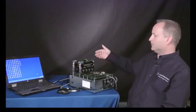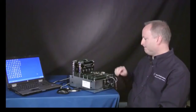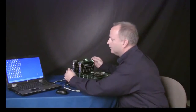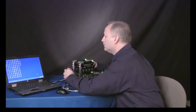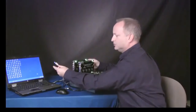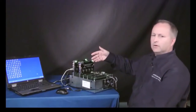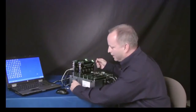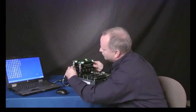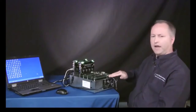In this configuration, the backplane simply is connecting the rear to the front. Power up our backplane with our front connector, and then we bring up our power. And for my exerciser cards, I need power and a USB connection to my host computer. The emulator, in this case, would also need power and a USB connection to my host. For a customer's device under test, you receive your power over the backplane.